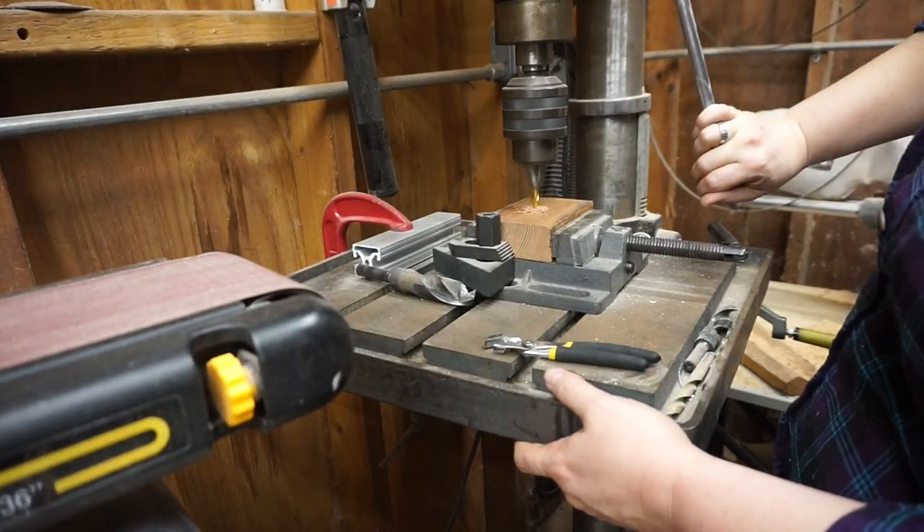In the last fails video, there was a spot where I showed an instance of blowout. When you don't put something behind a piece of wood and you drill through, the opposite side gets just all kinds of messy. I don't want to do that to my nice frame. So I just cut a few scrap pieces to clamp on the back side, and I drilled a little guide block on the drill press so the hole goes right through straight.